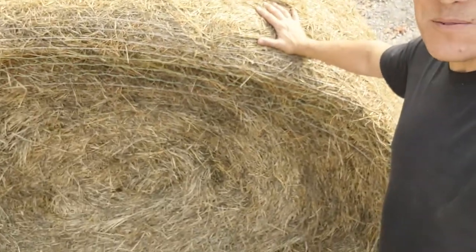It's the next day and this hay bale is still here. We attempted — we got the tractor over, put the bale spikes into it, and tried to lift it. I knew we were a little low on hydraulic fluid, so we tried yesterday and it was a no-go. Got more hydraulic fluid, ran it through the cycle a bunch of times, put it back on the bale, and tried to lift it again — no go. It lifted a little further but I think it weighs more than expected. We were told about 1,100 pounds; the tractor is rated for 1,300, so we were in that margin, but I'm suspecting this is more like 1,500.